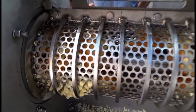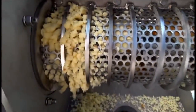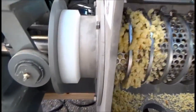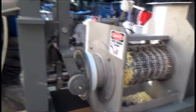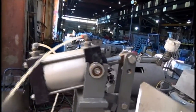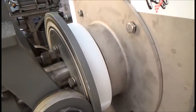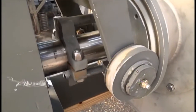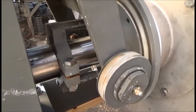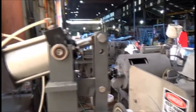It's going to pack up here at the end. Interesting to see how a screw press works — we feed it along and it's being pushed along by the flights, packing down at the end. Eventually I expect this discharge cone to open. They have the air pressure set at 1 and 1/2 bar, about 22 psi. The air cylinder pushes this arm, which in turn pushes these wheels against this cone. The cone is rotating because it's clamped in place by this collar right here on the shaft of the screw. As the cone goes open, the axial pins will slip in that collar so the cone can go open and shut. It's pushed shut by the air cylinder.